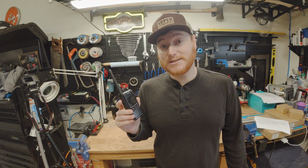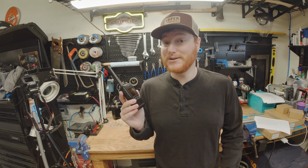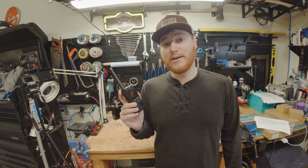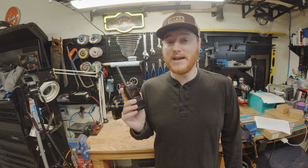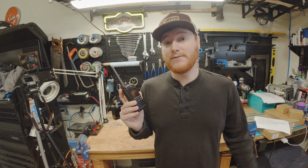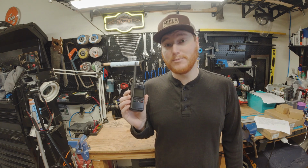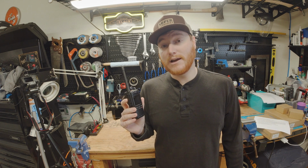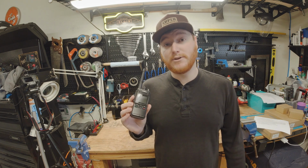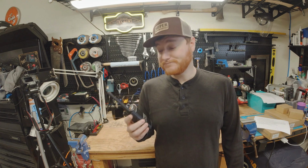Obviously, as you saw in the range test there, we made an incredible long distance range test with clear line of sight, approximately 34 miles from where I was up on a hill to my friend's place where he had his handy talkie piped into an external antenna to get above the roof line of his neighborhood. And we had pretty darn good communications considering that this is only putting out around 3 watts on frequency as we're going over the air. So that is pretty cool. The audio quality sounds pretty good in my opinion, and I think this definitely would be an option and contender.